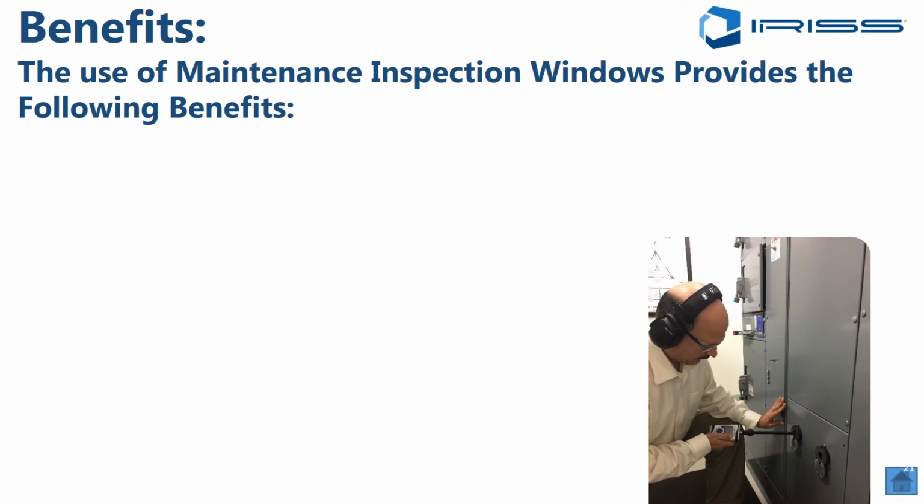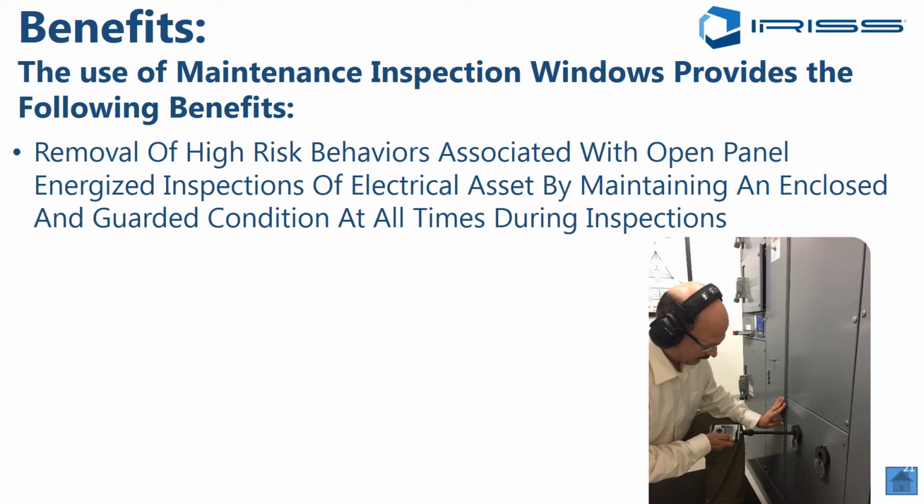So let's recap. What are the benefits of using maintenance inspection windows? Number one, we're removing the high-risk behaviors associated with open panel energized inspections of your electrical equipment by maintaining everything in closed and guarded conditions at all times during the inspections. We're able then to do the inspections under full normal load conditions, which is when we're going to get the most value from doing these types of condition inspections. We can't do them de-energized. We can't do them under low load conditions. We need to do them under full load, normal load conditions.